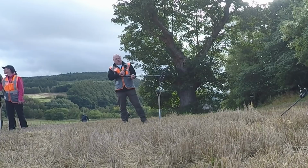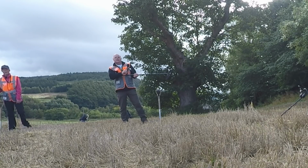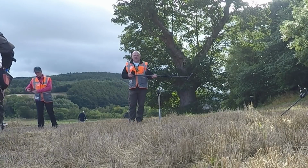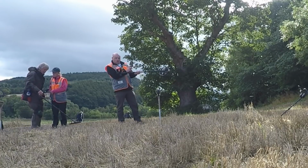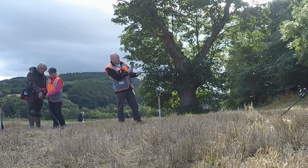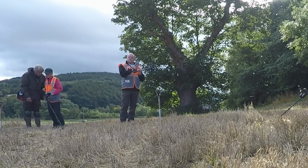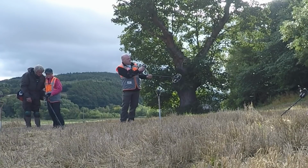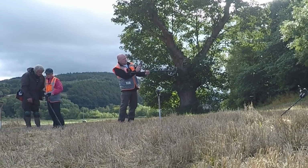I'll just go back on. Derek, confirmation whether or not it's on the ground balance. If the icon's on, does that mean it's on? Basically, if you ground balance it, if you go in there and that is reading anything apart from 0, then your machine is ground balanced. You've got the icon on the top right hand side. Up here? Yeah.